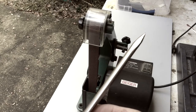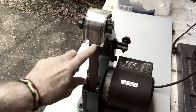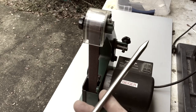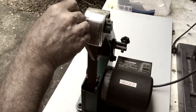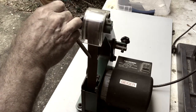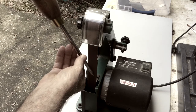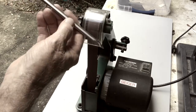If perhaps you didn't get a really smooth result — I think this one's pretty good from the 80 grit — you can try to improve that surface by going to a belt sander like this. This is just a narrow one-inch belt sander, an inexpensive one. I want to show you how I would improve that bevel and make it smoother. Just hold the tool straight down and get above the platen — the platen's right here. If I go too low it'll start banging because there's a joint in that belt, so I'll try to stay above it.